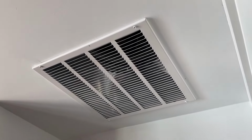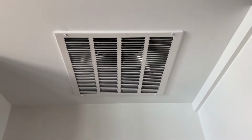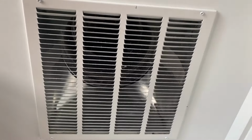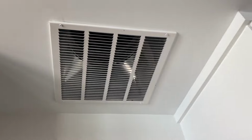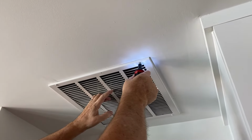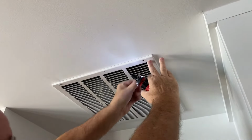We also noticed that the vent cover needed to be turned around. When approaching the vent and looking up in this case, you can see up into the return air vent. In this case, the vent cover simply needs to be turned around. Since this one was a bit dusty, we cleaned it while we had it down and then reinstalled it. After installation, it required a bit more tuning, if you will, to completely eliminate that annoying noise.